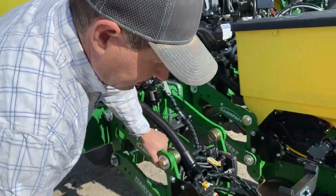Moving back just a little bit further on the closing system, there's a weight pin that is sensing how much weight is being pushed into the soil on these closing discs. These closing discs actually go into the soil, engage in the soil, and push the trench closed. Then we stitch it up and firm it with these back wheels. This load cell is communicating the same way as the rest of the row unit — how much weight we're applying. This module is opening up and closing, letting air into this air bag so that we are applying the desired weight on this closing system, row by row individually.